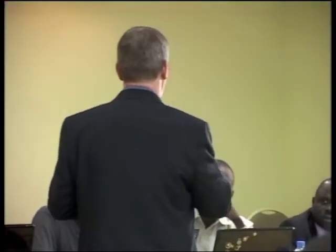Yeah. Thank you. The idea is that we're trying to find a compact soil. And if we use some portions in the sidewalk, it's usual to have trees there. Most of the trees have roots that just go down in the soil, but some trees have roots that go in different directions. In some places it's usual to find even the pavement moved up because of the roots. If the cable is in the way of these roots, the roots could change the way of the duct and cause bends and even could affect the cable in a way that interrupts the fiber communication.